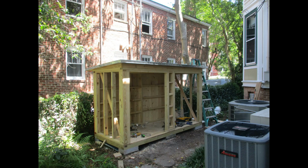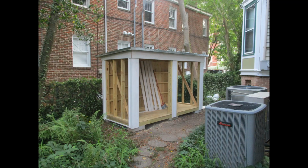It's a shed with a roof, watertight on the roof, and I've got a back wall, and I just have to do the doors and the two ends and all the trim. And now I got kind of fancy with the trim because I wanted it to look a lot like the house. And now the first trim boards, and by the way, any trim board that I put on, or siding or whatever, I prime front, back, sides, ends, everything's primed in advance.